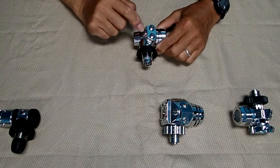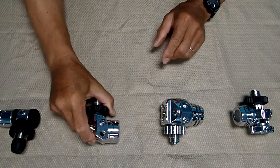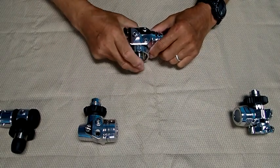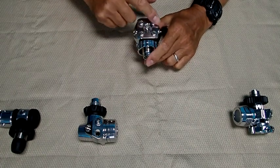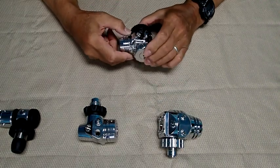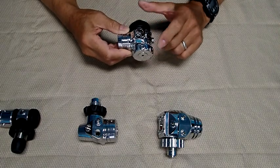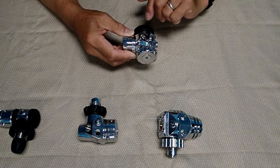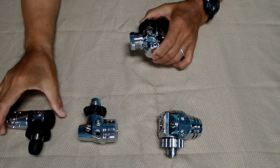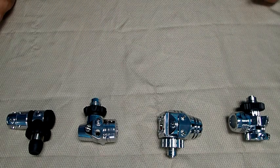This generic clone is a four or five low-pressure port regulator — two ports here, a high-pressure port, two more ports, and another high-pressure port. Sometimes it has another port on the bottom. The Mares diaphragm regulator is similar but has a larger housing and more ports on the bottom. The last regulator is the XDeep NX700, which is unique because its turret is in the same axis as the DIN fitting, whereas conventional ones have the turret at 90 degrees.